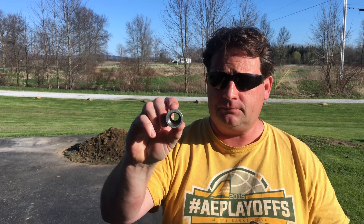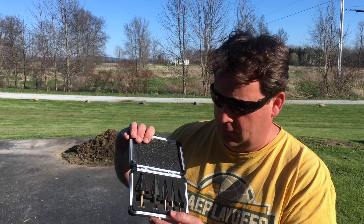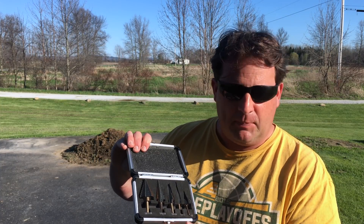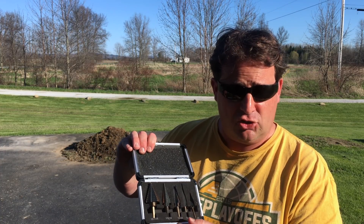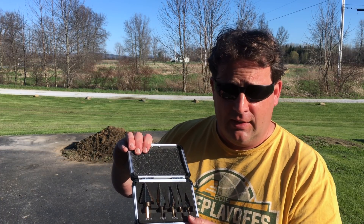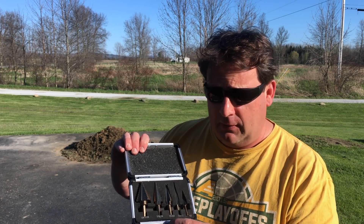I'm going to be putting that on the side of the DIY solar pool heater using this half-inch to three-eighths bushing reducer. The half inch fits the thermometer, and that's going to be recessed into my 2x4 like this going in. To do this I'm going to use this step bit set I picked up on Amazon — very inexpensive, product link below. It's got different sizes, should make a perfectly round hole so I can go a little bit by little bit and fit it perfectly for that bushing.